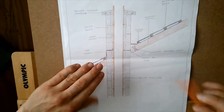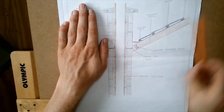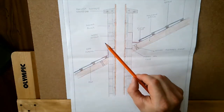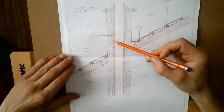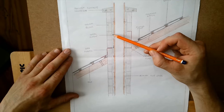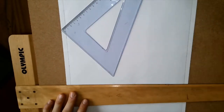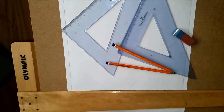The best approach is to draw the chimney stack itself first — forget about the rafters, tiles, and pen work for now. We're going to focus solely on drawing the chimney stack with block work going all the way up, a bit of infill cement, and flue liners. We'll use 100mm block, about 50-70mm of infill cement, and 250mm diameter flue liners. Equipment needed: T-square, 60/30 set square, 45 degree set square, 2H and H pencils, rubber, and red, black, green, and blue pens.